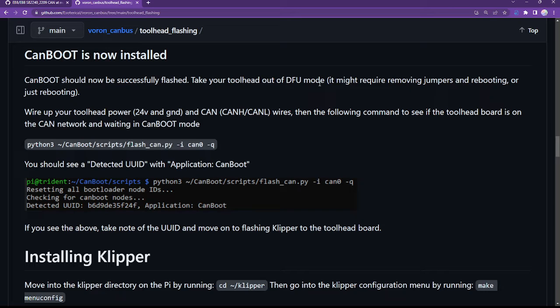That comes next. We flash CanBoot over the USB connection, but then we'll actually test our CanBoot wiring, or CAN bus wiring, to flash Klipper over the CAN bus wires instead. So it's a good test of the CAN bus wires, to know that everything's wired properly, if we can successfully install Klipper over it. So coming back to my test bench,